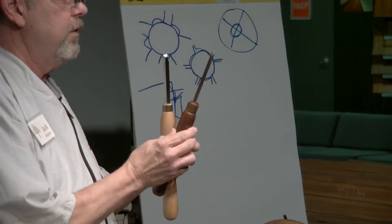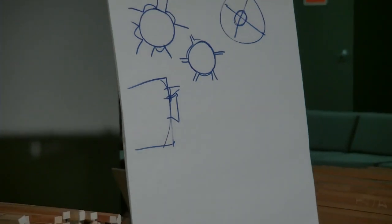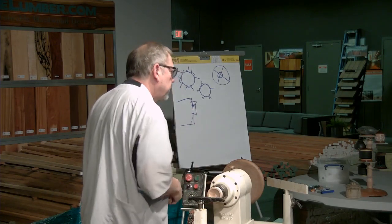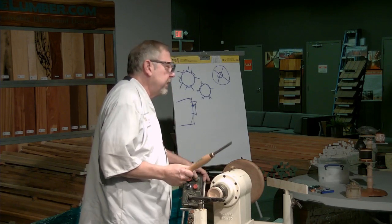You see that? You can come right straight across here and put a double, and this is double, it's sharp on the side and it's sharp on the top. So that if I keep this tool parallel to my bedways, I'm gonna have a straight side for the top of this box. Everybody follow me? Did I lose anybody? Would you tell me if I did?